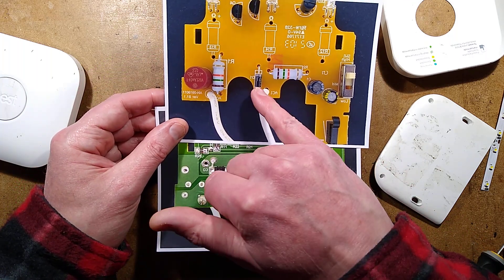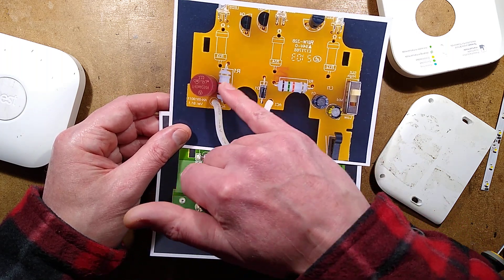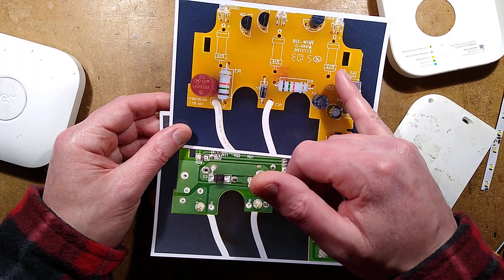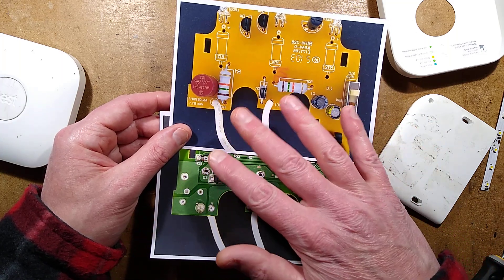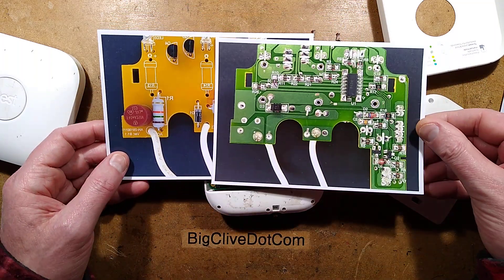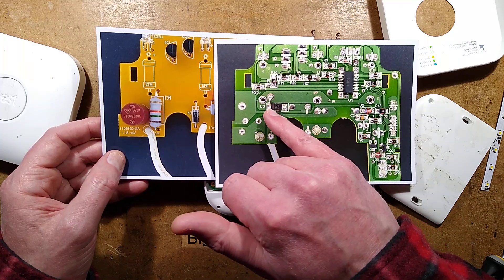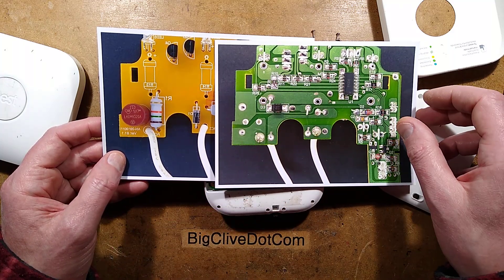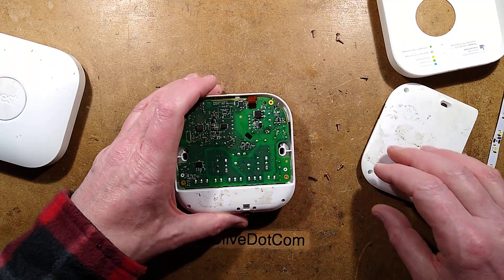The reason for having two diodes in series is: if one went short circuit, these resistors would then operate at full power, dissipating roughly one watt each — still within their rating — but the unit would stop working and potentially get quite warm inside. Because there are two diodes in series, if the surface mount one went faulty, the other one would still work. It adds a layer of redundancy — quite useful to know. I shall keep that in my mind for future.